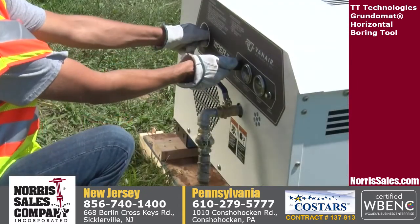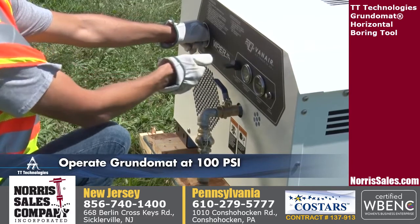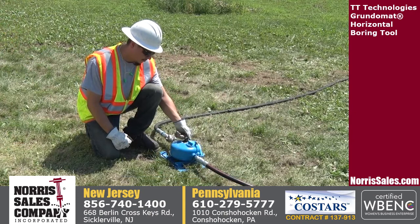Start the compressor and check pressure. The Grundomat should be operated at a maximum of 100 psi. Adjust oil flow on the lubricator per the diameter of the tool.